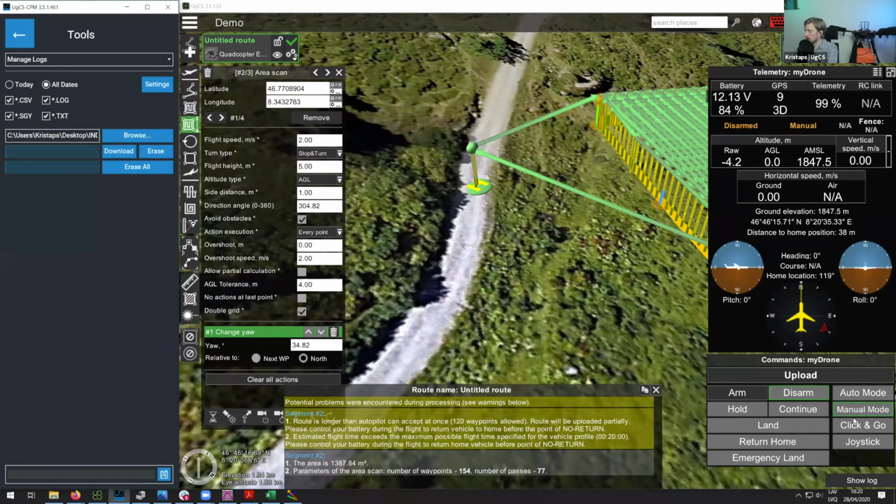Yeah, another question is, how does the GPR react to water bodies, so small rivers or ponds? This is actually one of the applications of GPRs. We have actually a sample data set from when we did bathymetry over lakes in Denmark. So as long as it's freshwater and not saltwater, then you can actually use a GPR to perform a bathymetry survey. And even from this, what you can do is reconstruct a 3D model of that in many cases. Let's see if I have it here.